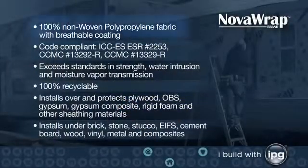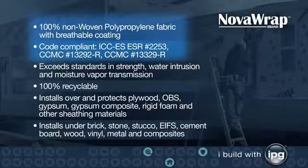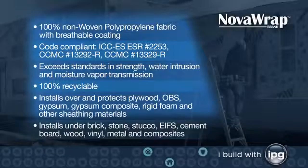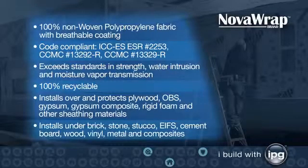NovaWrap brand, 100% non-woven polypropylene fabric with breathable coating. Code compliant, ICC ES ESR 2253, CCMC 13292R, CCMC 13329R. Exceeds standards in strength, water intrusion, and moisture vapor transmission. 100% recyclable. Installs over and protects plywood, OSB, gypsum composite, rigid foam, and other sheathing materials. Installs under brick, stone, stucco, EIFS, cement board, wood, vinyl, metal, and composites.